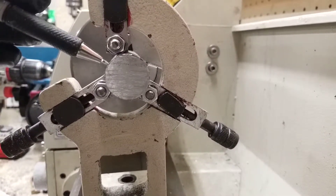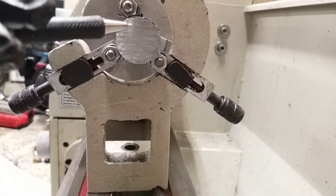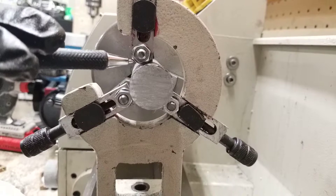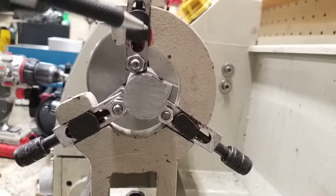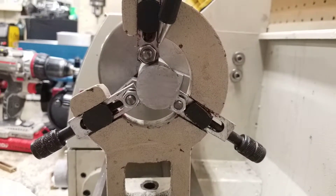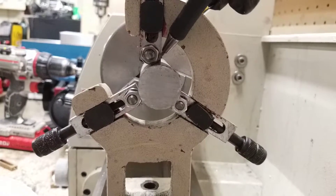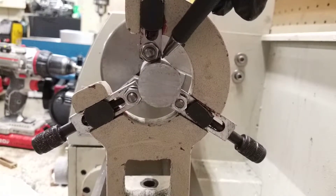I have a one inch piece of aluminum as a test piece. As you can see, the bottom piece lines up pretty straight with the center, but the other two go at such an angle that the corners of the aluminum pieces we just machined are digging in right here and right here. So I'm going to take this back off and grind down the edges of the aluminum and the nuts that might be interfering.